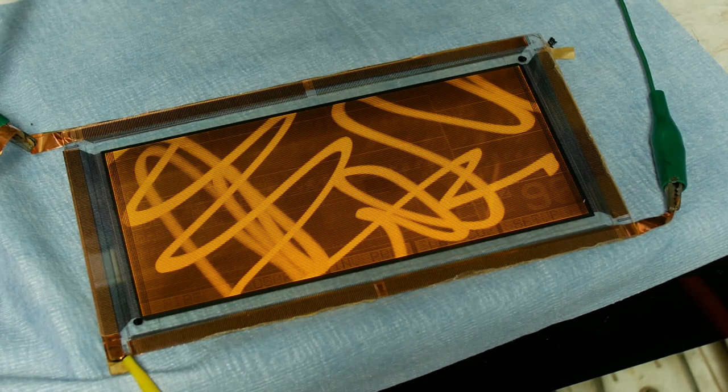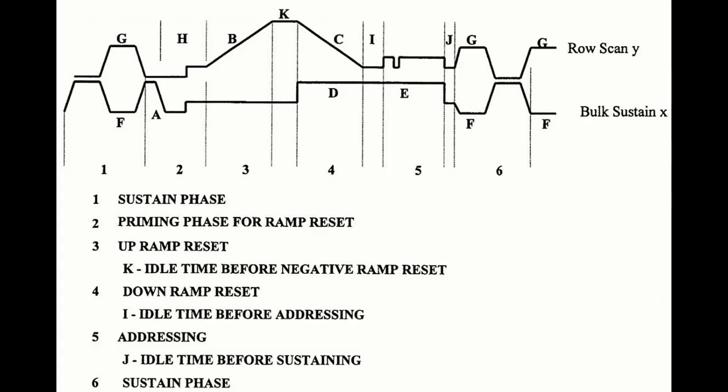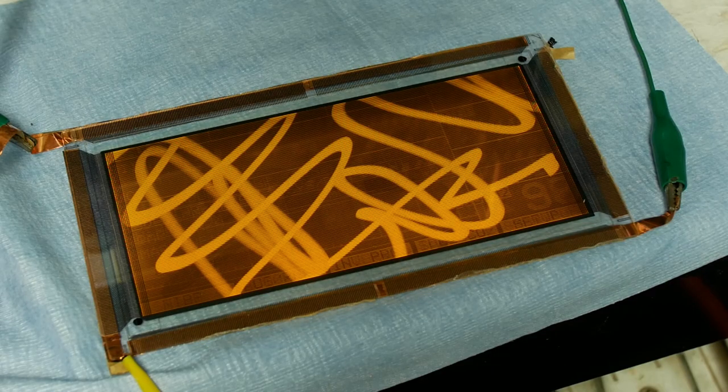I also thought quite a bit about color plasma televisions, which are actually much more complicated than anything we've discussed — typically having three to four electrodes per subpixel and using addressing, sustaining, and ignition electrodes with a very complicated drive waveform. There are plenty of patents out there, but it's just more complicated in almost every way. Part of the reason my video output has been lower is because I kind of nerd-sniped myself — thinking I should build my own driver circuit, or get a color plasma TV, or build my own single-pixel plasma display, or play with dielectric layers. There's really just no end to the rabbit hole, which is good because we wouldn't want to run out of cool things to discover. But sometimes it's just time to make a video. I hope you found that as interesting as I did — it was quite a journey and I ended up learning quite a bit along the way. I'll see you next time.